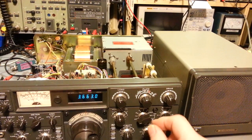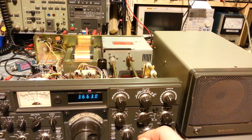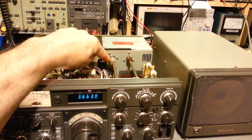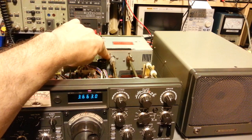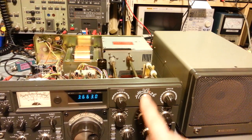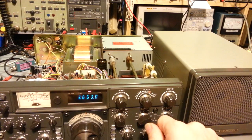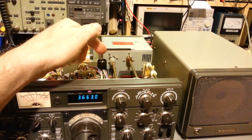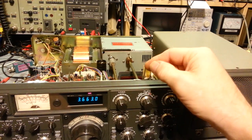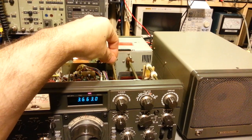Now, when it breaks, try to make sure that you line up the set screw holes. There'll be impressions on the shafts. Just like in the case of this one, you can see those two holes, the hole in the front and the hole in the rear of this coupler, they're perfectly in line. So when you go to retighten your set screws, do it before you push this front shaft in. You pull the shaft out, take your old coupler out, and stick your new coupler in. Make sure you note the orientation, where there'll be a little mark on the shaft where that original set screw was tightened down.